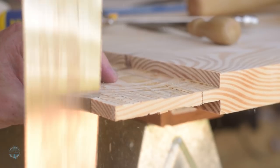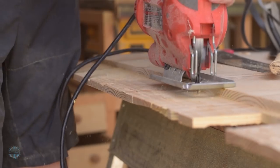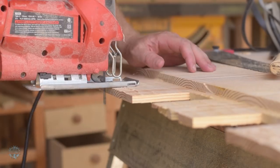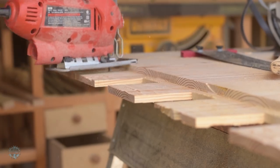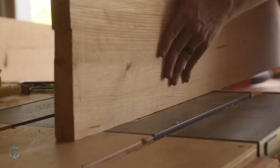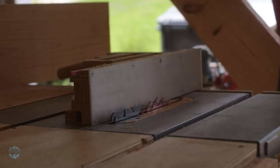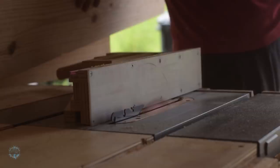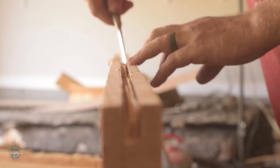I left a three-quarter inch shelf on the end and then cut out the tenons using a hand saw and jigsaw. The shoulder was too close for the jigsaw to fit, so I had to lift it up and use the top of the table as a reference surface. I set my table saw to the depth of the shoulder and ran the breadboards through several passes to get the thickness I needed. A quick clean up with the chisel and it was time for the mortises.